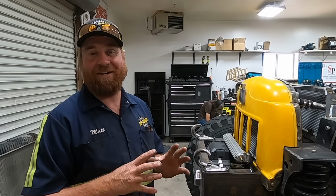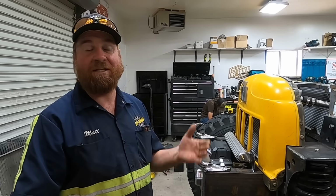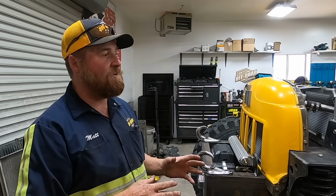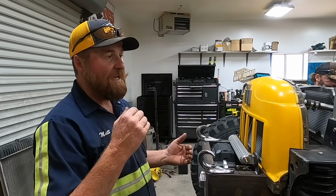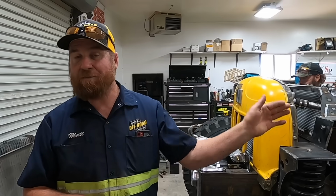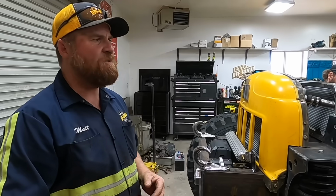It's not a wrecker. It does have a boom. It's a fixed boom. It's not functional. It does have a winch in it, so it can winch things, but the actual vehicle is not a wrecker. And also, since it is a show vehicle, a promotional vehicle, it doesn't have heavy duty parts in it. The axles in it are pickup axles, so it's got a Dana 60 in the front, and then the first back axle is a Ford 9-inch, and the next axle behind that I think is a Sterling 10 1/4. So anyway, it's light duty truck based axles.